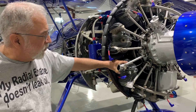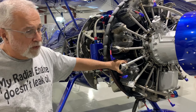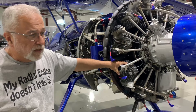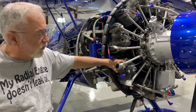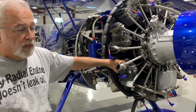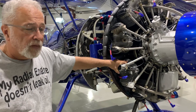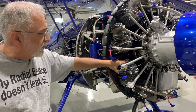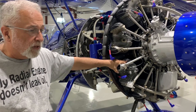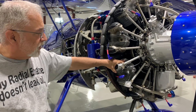So we pulled the cylinder off. Indeed, when you put fuel in the top part, it leaked a little bit, which would indicate that it was not sealing well. So we took this down to Central Cylinder in Omaha, Nebraska, and our friend Scott Erickson, along with George Zernicki and his crew, were able to build the appropriate machining to machine the valves on this particular cylinder.